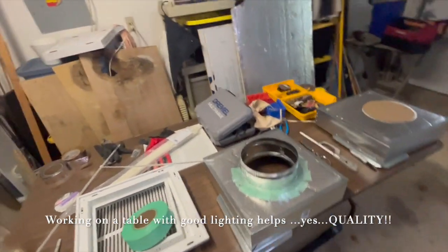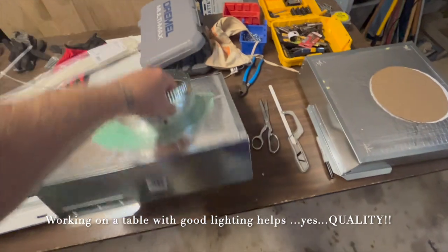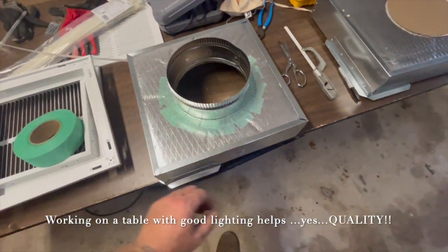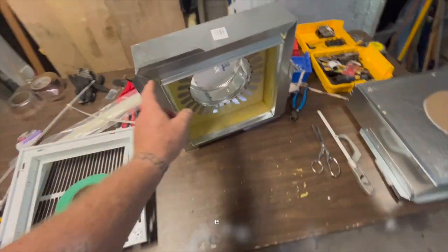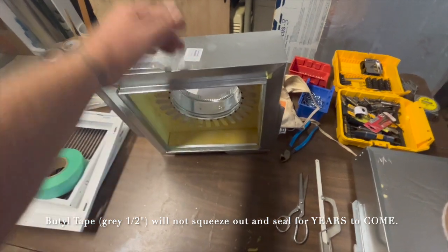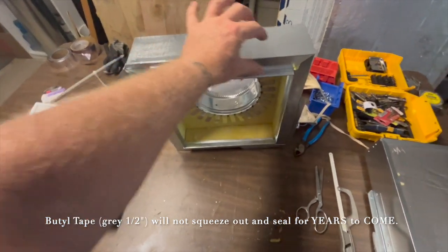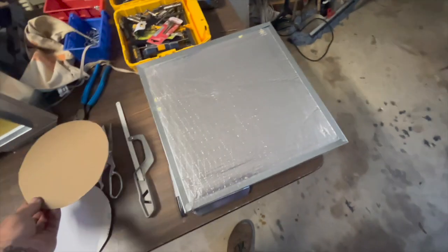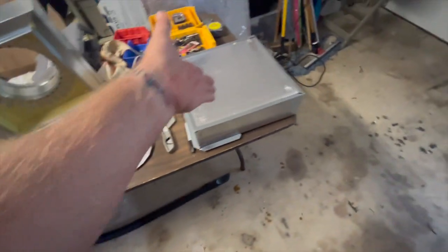Some things you can do in the garage and not up in the heat of the attic. I'm going ahead and putting my interfaces into the registers. I like using this tape for some structure, then push them in, put mastic all around, and I'll also use butyl tape around here. Rather than caulking — which squeezes out when you put your two-by-fours in — the mastic has real structure and tightens up the seal. Templates are our friends: an eight-inch circle. You don't want to angle this one because you want it to drop straight in for the fingers.